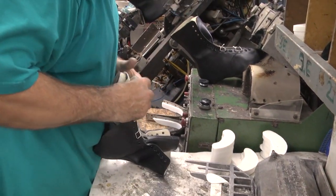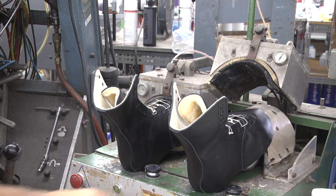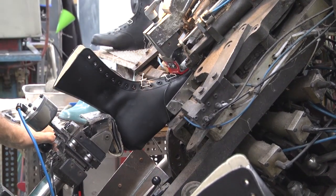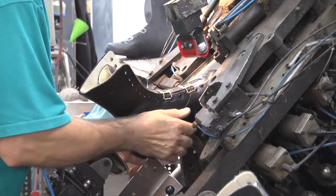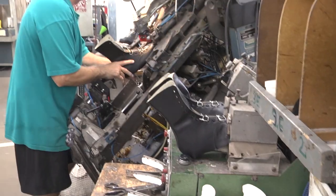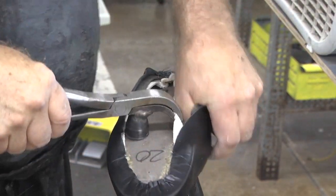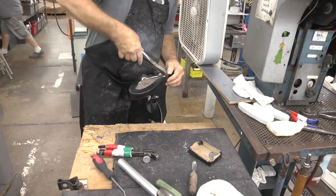Marty is taking a box toe and running it through the solvent. That piece of material will get hard after we make the shoes, and that's what gives you the hard toe on a skate. The next operation is pull-toe lasting. We put the shoe in the machine and into the pinchers, load the pinchers — it'll do the holding on it. He centers the toe and now it's cementing it on the bottom. That cemented the lining. Now he'll pull it one more time, which will cement the upper material, the black material, down to the last. Tom is using a lasting pincher to grab the lining, get all the wrinkles out, straighten the back seam, and put the counter in position. Then he'll pull the upper over and put a tack in there, and that'll hold it in position for the next operation.